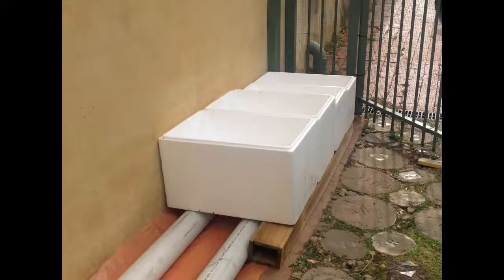At this stage I should mention that I went with stormwater PVC pipes as opposed to pressure PVC pipes, because I didn't realise there was a difference in the chemical composition of the pipes, and I figured that the application doesn't require pressure, so stormwater pipes would be just fine. What I now know is that there's actually quite a difference in the chemical composition, and that the high pressure PVC pipes are actually suitable for potable water or drinking water, whereas stormwater pipes aren't, because they're made from recycled plastics and people don't know where the plastics have actually come from. Or perhaps I should say pressure pipes are more suitable for potable water than actually suitable.